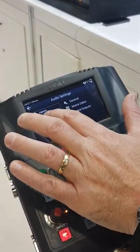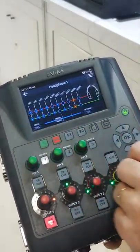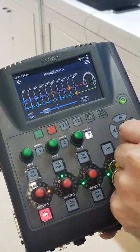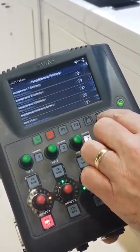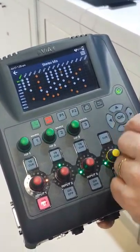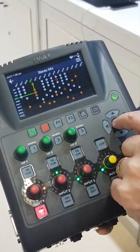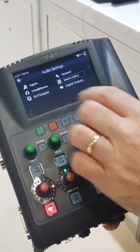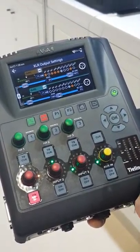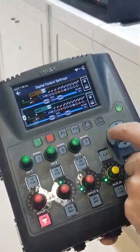In addition to this, we have the ability to have custom headphone mixes. For each one of the headphone sources, they can be individualized for each user. In here we have a matrix editor that is fully configurable to the crosspoint, where we can route inputs to outputs. We also have control over what goes out the XLR routes and the digital outputs.